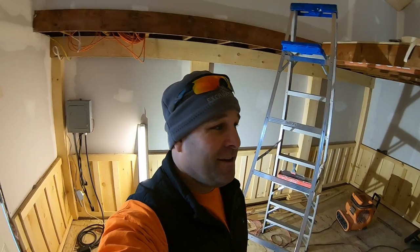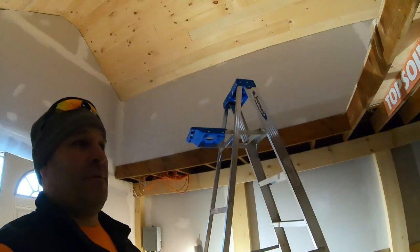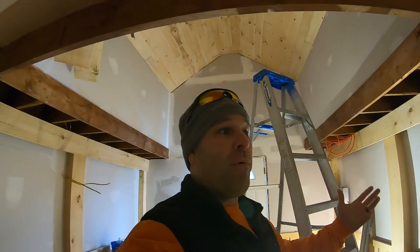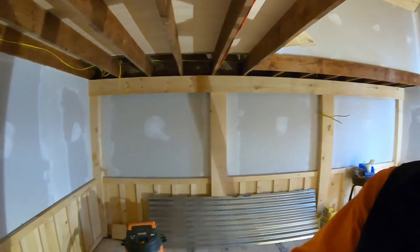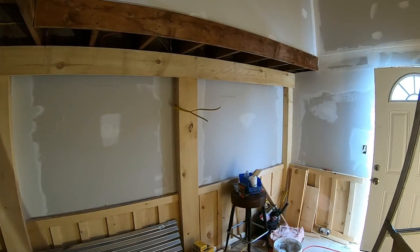There's actually a worse step than hanging and first coat, and that's sanding. So the better you get your second and third coats, the less sanding you will do — it's very important to take time and don't rush it. Look at my floor — how clean it is, no splatters, nothing. When I first started I had more mud on the floor slipping off the trowel. You just learn techniques over time. This is the second coat — I may sand tomorrow or do a little touch-up third coat if there are any imperfections. I'm liking what I see.